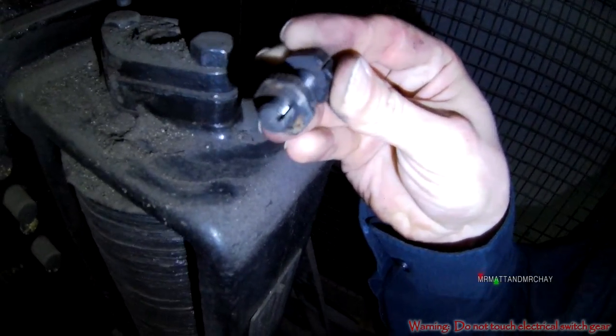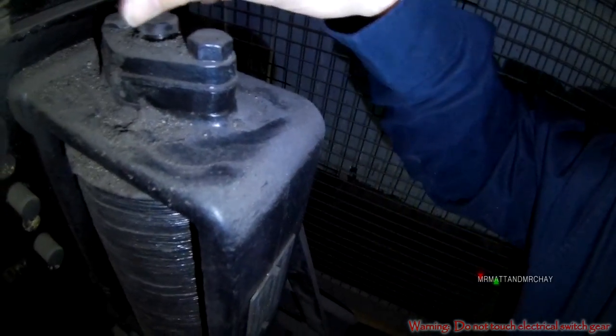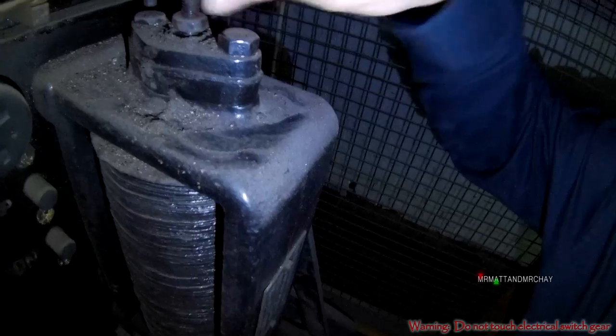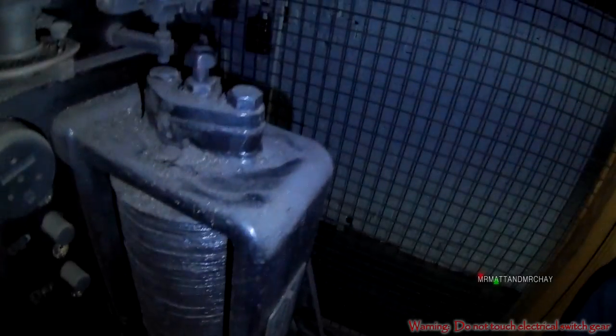In this screw thread is a slot with an adjustable nut that covers it. This creates a very basic air valve. The amount of air controls the speed of the rising accelerator rod.